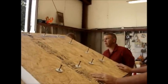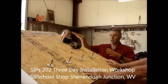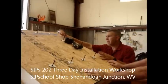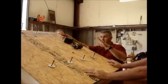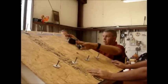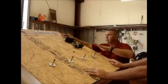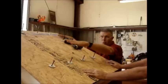If you had a couple of screws in this panel and you weren't sure whether you were following the ridge or your building was out of square, it becomes very obvious once you set the next panel or the panel after that. So it doesn't hurt to only put enough screws in here to hold it in place and continue to add more panels.